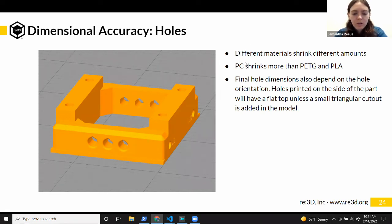How does shrinkage affect the dimensions? PC shrinks, so the holes will get a tiny bit smaller. Your PETG and PLA holes are going to be more accurate. The whole part shrinks a little, which can affect the distance between holes as well as the hole itself. Especially with smaller holes, you're more likely to see problems. The holes on the sides take heat-set inserts — if the holes have shrunk too much and are too close together, the mounting piece may not be the correct width to work correctly.